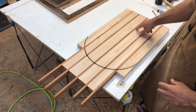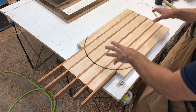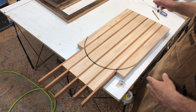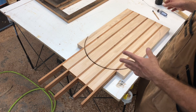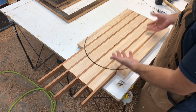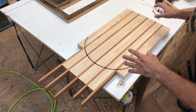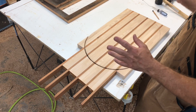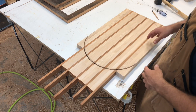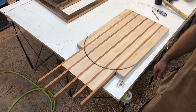You will have two holes here — that is the sacrifice you make, so this board wouldn't be two-sided. I like to use rubber feet for a couple reasons: it helps so things don't stick as much, and it also means if the client ever uses it and the board gets wet, it can stay dry — it's up off the counter and not causing any problem. I've had a couple boards blow apart where the client dried it, let it sit flat on a counter, and the moisture couldn't escape and it just blew the board apart. So that's where the rubber feet, for a bigger board like this, are pretty handy.